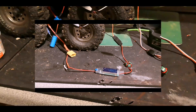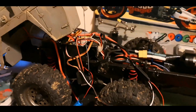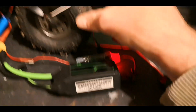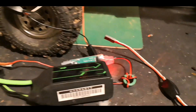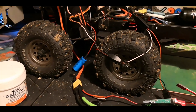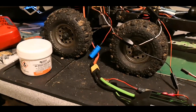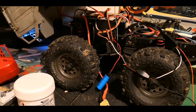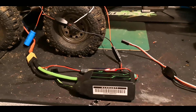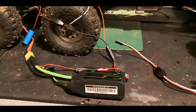It does all work — let me just power it on for one second. Right, it's on, I'm plugged in, everything's kicking — it's all beeping away and chirping, servo creaking away as usual. I can turn the wheel. The power is running through the BEC into the servo directly. Obviously I can't run it around on the bench because it's colossal, but there you go. The glitch buster will stick around for now. I hope you found that reasonably clear and entertaining — thanks guys for watching and sticking with us, cheers.